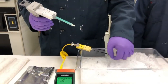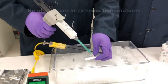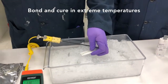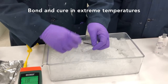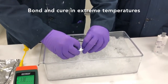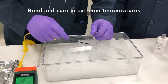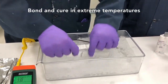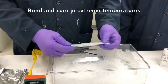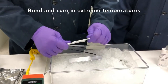We've also had buried in ice two pieces of aluminum we'll use for today's demonstration. We'll extrude a small bead of adhesive down one side of the aluminum, pull the other from the ice, and apply gentle pressure to the two substrates. We've got one piece that was prepared just a few minutes ago. As you can see, it's actually established quite good handling properties, even under this extreme cold condition.